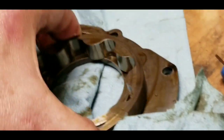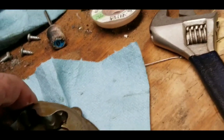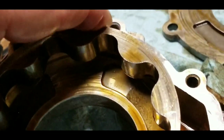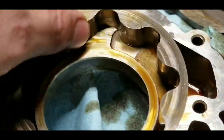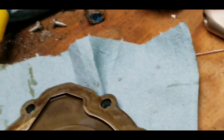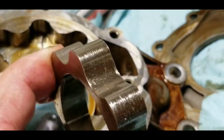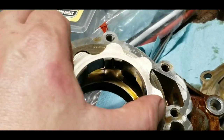This is the oil pump stator and rotor — there it is. You can see there's pretty excessive wearing on that, which is where most of the work happens with the oil because it moves in between these two as it pumps around.